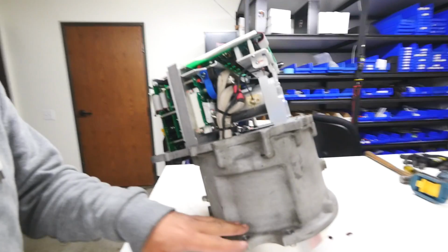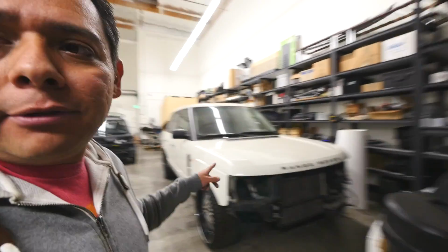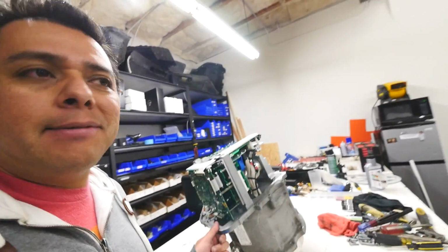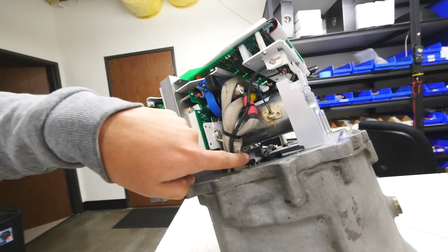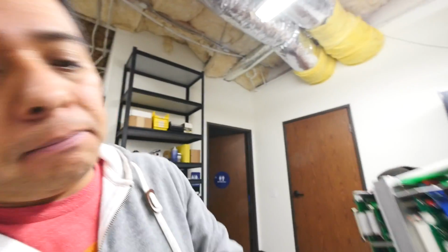And then the other thing that I want to do is, let's say if this works and it has the torque, I read somewhere in the specs that it has like 91 pound-feet of torque or so, 94 pound-feet of torque. Then all of a sudden, because we haven't actually ordered the motors for this guy, this becomes a contender. If there's so many of these available and we can get them to work, then what I want to do is unscrew these, and then this plate comes off, and you separate the motor from the controller, and then there's a shaft in there. We can figure out how to bolt another motor in the back here. So in this size, you have one motor or two motors with, theoretically, 180, maybe 200 pound-feet of torque.